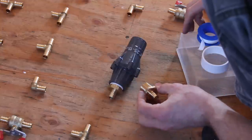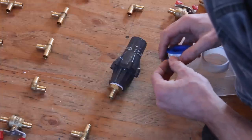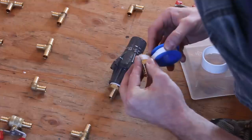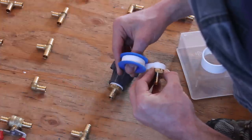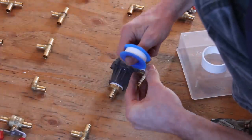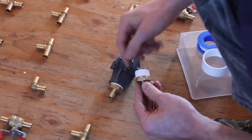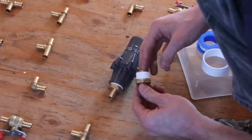There are a couple of spots where we're going to need to use Teflon tape for a threaded connection, so I refreshed my memory online by looking at some videos on best practices. The main things were to get it on clockwise so you're not unraveling it as you thread the other piece onto it, and I heard anywhere from three to seven wraps, so I'm going to go with about five. It's also mentioned to keep away from the first thread because if you have anything overhanging, when you thread on it'll shear that off and you'll have a little bit of tape inside the system that could get stuck in a valve and cause an issue.